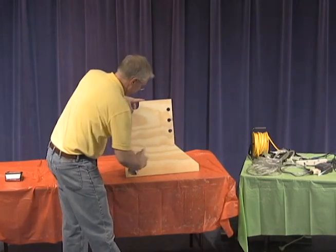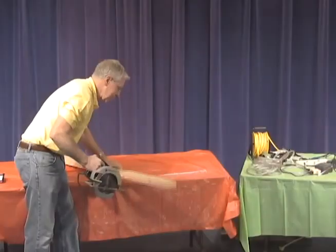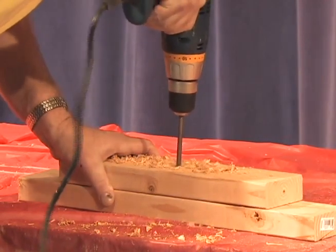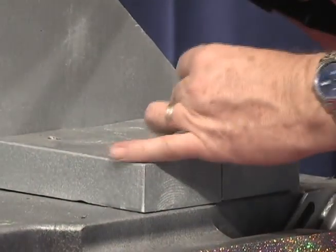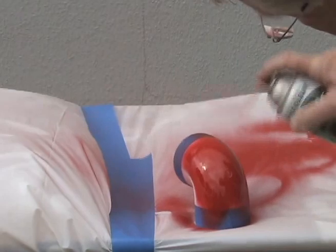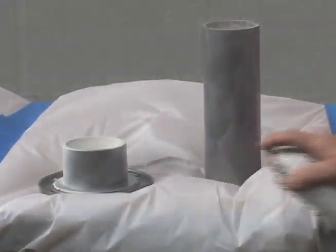Use sandpaper to smooth rough edges. It's a good idea to paint the pieces entirely before you assemble your cart — priming your wood before spray painting is another good option. Cut your 2x4s according to the directions. Midway in the vertical board, drill a one-and-a-half-inch opening for the electrical cord from the disco light, then paint one side of this vertical board. Paint the 7-inch 2x4s that will be used as pedestals for the sign apparatus. Paint your PVC pipe using plastic paint — here we have taped the PVC to make red stripes. Remember, you may want to prime the PVC if you are not using paint designed for plastic. Also paint the pedestal that will hold the red spinning disco light, the 6-inch pipe, and both flanges. Let dry completely.